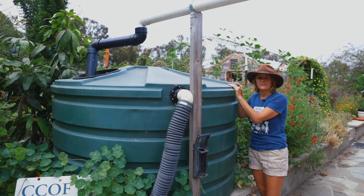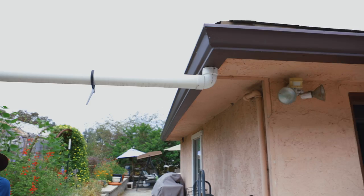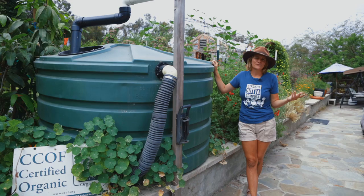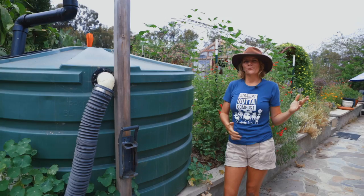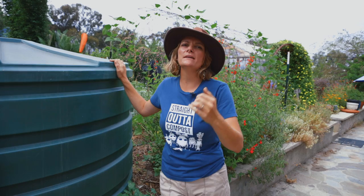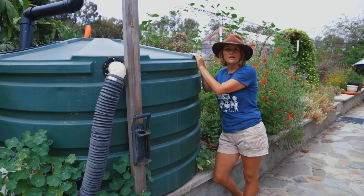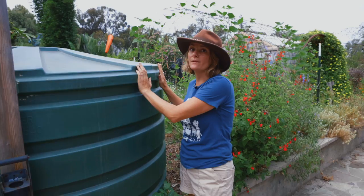By using this system, we are getting rainwater that hits the roof, moves off the roof, and goes into this barrel and several other barrels we have throughout the property. Now you might be thinking, well that's silly because San Diego County gets maybe nine inches of rain in a good year. Well, it's all about math. We have a 1,200 square foot roof, and when you multiply that size of a roof by the area and the amount of rain, in a 10-minute rainstorm this 800-gallon tank can fill up almost instantly.